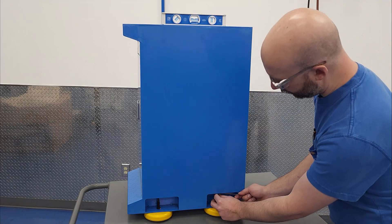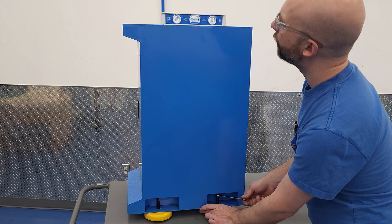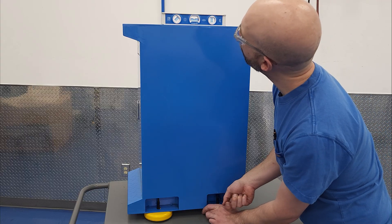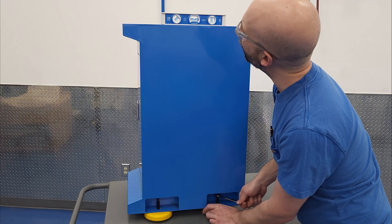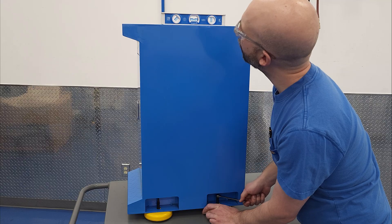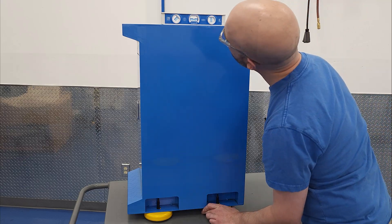With that in mind, just a few cranks gets me to the middle of a carpenter's level, and that's a good starting point when you're setting up a machine. I don't worry about a machinist level until I actually get the machine on the stand. Once you do get to the machinist level, the thread on the stud is such that you can get some very fine adjustments.